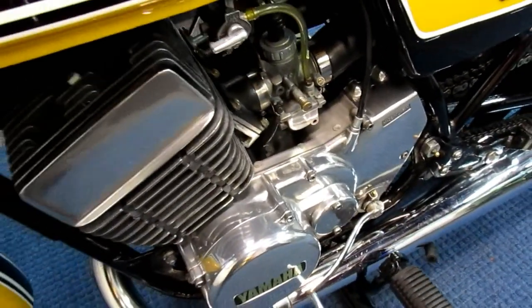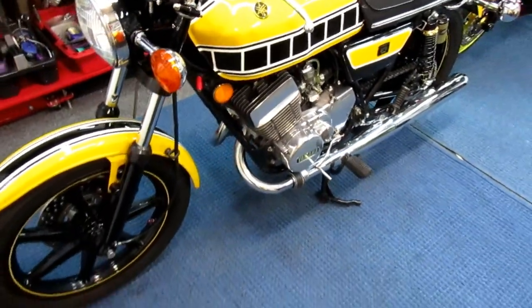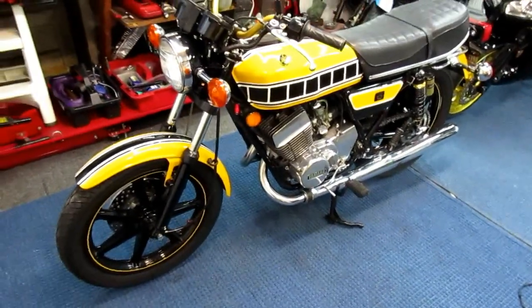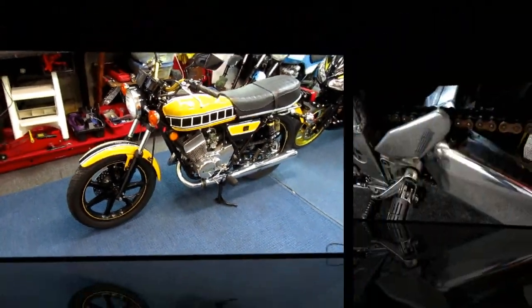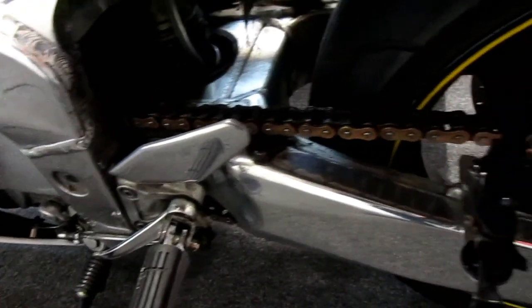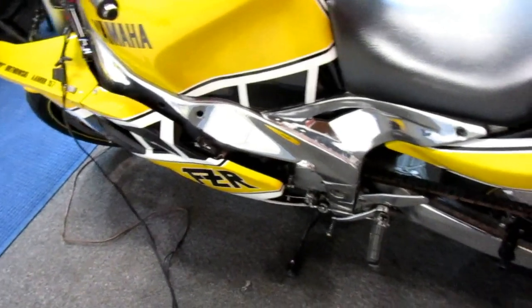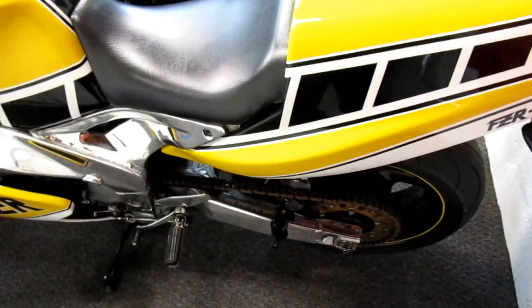And if you have a passion for these old air-cooled motors, or you have a Norton or a BSA or a Triumph, an old one, polishing those cases is one of the joys of owning these old bikes. Now, I did the swing arm on this bike and on the 752. And that, again, becomes a really big job because you really can't easily take it off the bike. But parts like this that you can take off the bike with a couple of bolts, very easy to do. You can take the shifter off, very easy to do. The frame, not so much. Order yourself a pizza because it's going to take more than one polishing session.